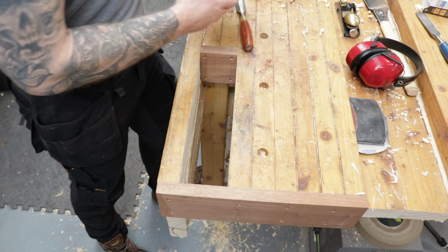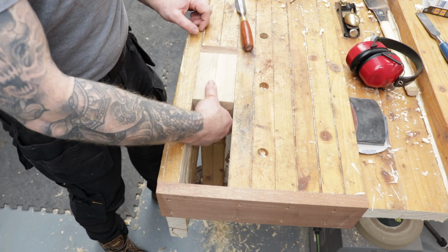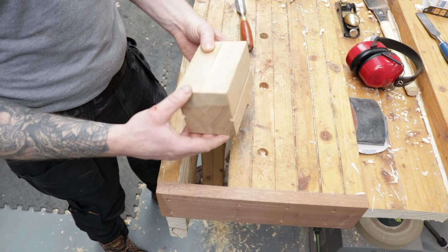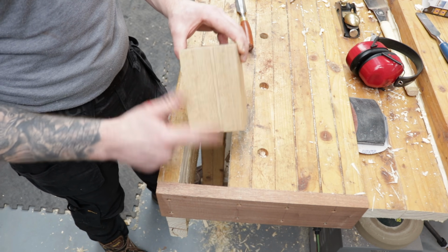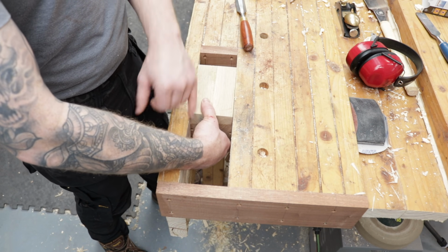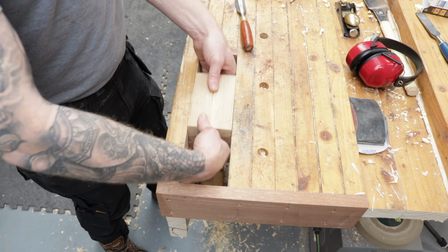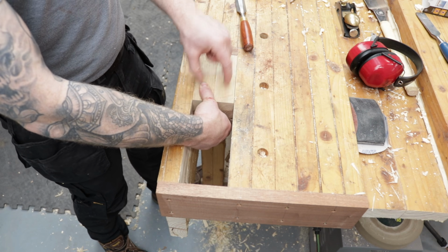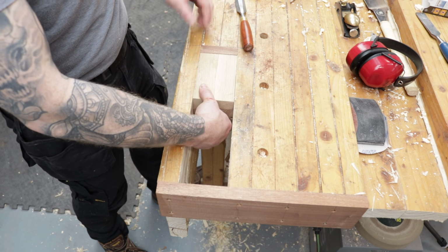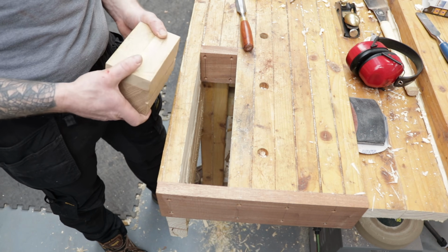Now I have the oak block here, so this is just the oak block that's going to act as our vise for holding our dogs. That's going to move up and down on the screw inside in here. This is just scrap bits of oak that I've glued together, 2 pieces that I glued together. Ignore the grooves in this, they were existing in the piece already. Like I said, I'm just using a scrap piece. So that's going to sit in there. The screw is going to run through this, and the flange plate on the vise kit will actually screw to the end of this, and that will move up and down inside in there with probably 4 dog holes in this. And we could actually use this end as a clamp too between either side of the screw. So that's where I'm at. Now the next thing we want to do is get this all marked up for drilling our holes to take our screw. So let's get on and do that.